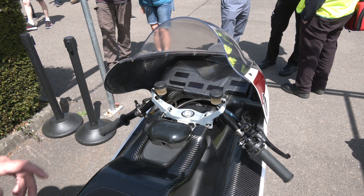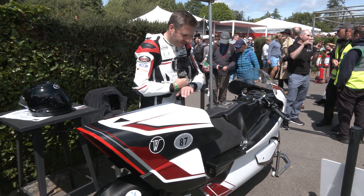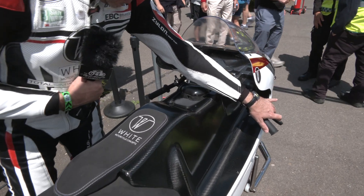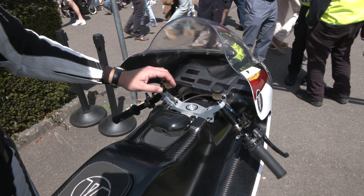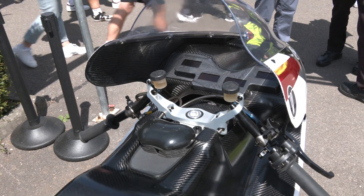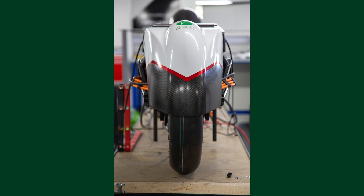What we've got is quite a radical riding position. The upper torso is very similar to a Moto3 position — we try to get the back as flat as possible so we can keep the airflow coming off the front screen onto the helmet and down the back onto the rear of the bike, losing as few aerodynamic losses as possible. Because it's electric, we've got the throttle on the right bar, front brake on the right bar, and rear brake on the left bar — and that is it. We monitor the motors on this powertrain — front left, front right, rear left, rear right — monitoring the energy they're deploying, temperature, and the RPM they're running at. There are also control cables running down from the headstock, rotating through the bike down to the upright at the front.